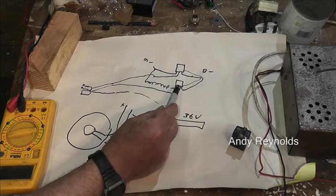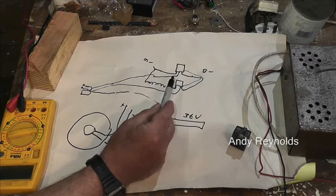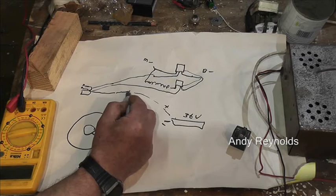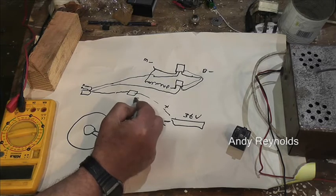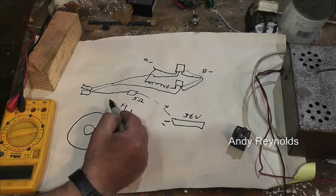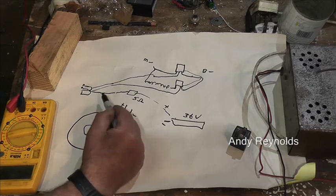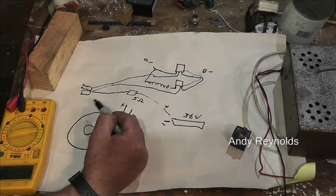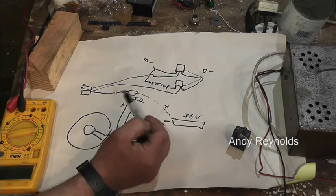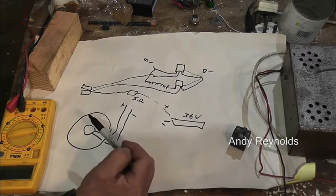But that's a 12-volt relay and this is 36 volts, so I put a 5-ohm resistor — quite a large one — in there to resist the flow of current. That means the coils in those relays don't burn out. It's very simple and you can fix it yourself.